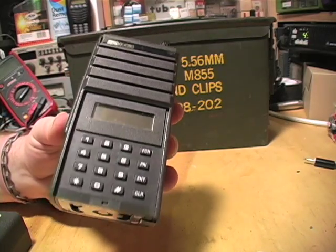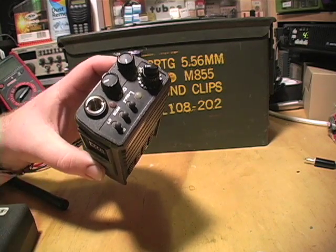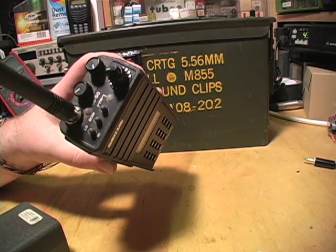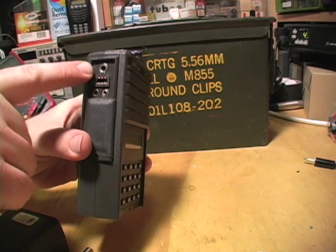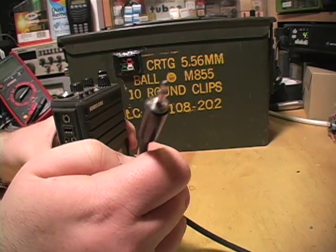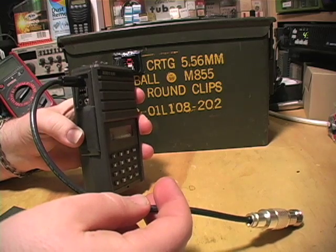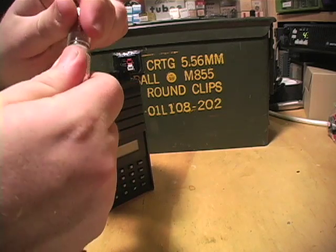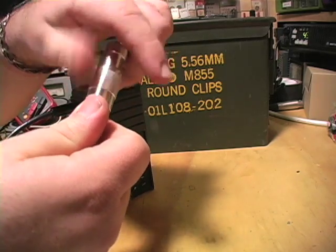So this is what the radio looks like by itself without the battery and without the antenna. It's got a kind of a weird stud mount that only Bendix King really uses, so you might wonder how to get an antenna to plug in there. There's a 50 ohm output on the side that uses a regular eighth-inch cable, like so. You can get these at places like Radio Shack — they're really ubiquitous and easy to find. I've got a piece of RG58 and connected it to a regular UHF connector with a turnaround, so you can attach this to any external antenna.